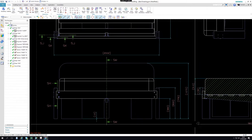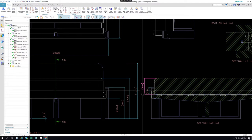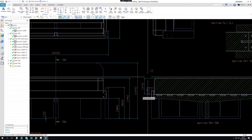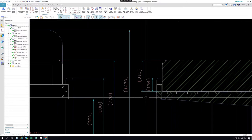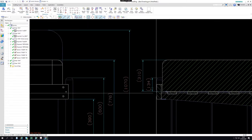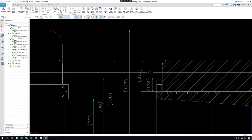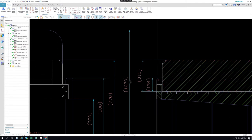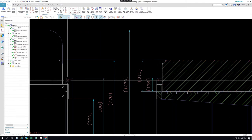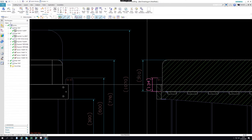The bed's actually quite high. I modelled it around the mattress that we've got, and the mattress we've got is just over 300 millimetres thick, so it's quite a thick mattress. I think if you've got a mattress on this particular bed, anything over about 135 would be about right. You know, 150 would be perfect. I think you'd want the mattress to just go over the leg a fraction, or you'd have to cut the leg probably down a fraction if you wanted to use, you know, a thinner mattress than 134.